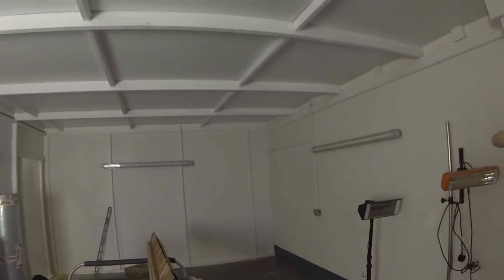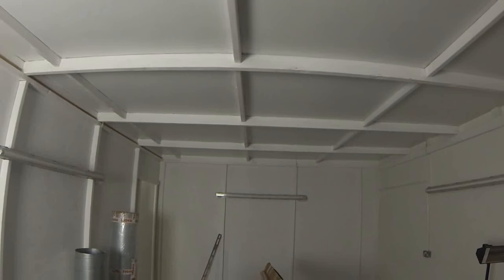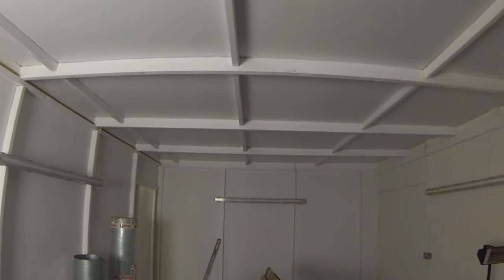It's the same height as the 8 foot panels, obviously. And then the beams going across the ceiling are 4x2s. As I say, the width for them, we got them in one length, completely one length. We didn't want no joins on them ones. And these little ones going across here, again, it's just a 3x2, just to fill in and support the actual, I think it's 6mm ply or 9mm ply on the roof, and that just acts as the roof for us.